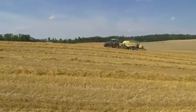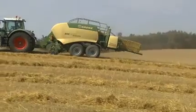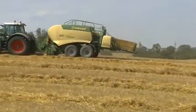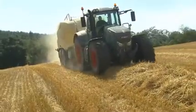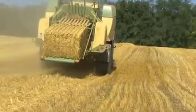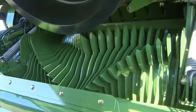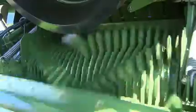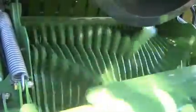There is a growing demand for chopped straw because these bales are easier to break up and spread. There is another compelling reason to opt for the well-proven 26-knife X-Cut cutting system for a BiG HDP2. The X-Cut rotor cutter is 720 millimeters in diameter and has 5 rows of tines to cope with those massive throughputs. The tines in chevron arrangement have wide Hardox plates that help feed the crop to the rear and pull it through the rows of knives.